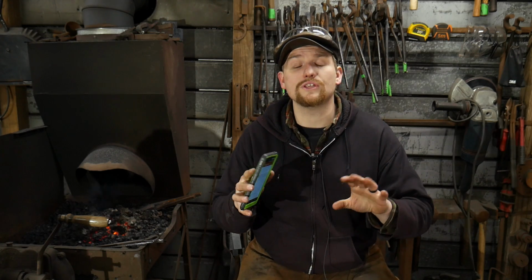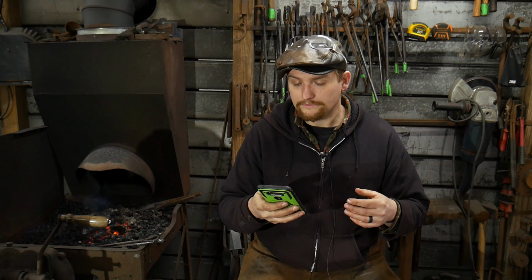In the meantime, till I get around to making my version of welding in a gas forge, I can tell you how that video will basically be summed up. Make sure that you have your oxygen to fuel ratio correct. Make sure that you have a properly insulated forge that can achieve welding heat, and then you should be just fine. Also, you asked, you just picked up a forge, but you don't have a building yet.